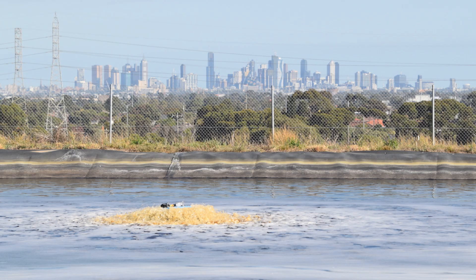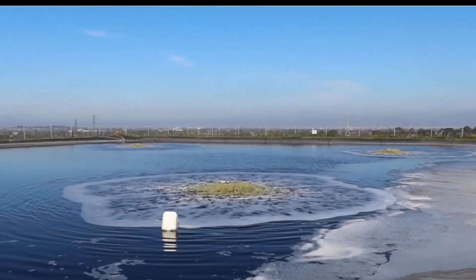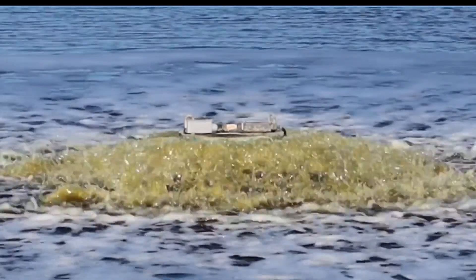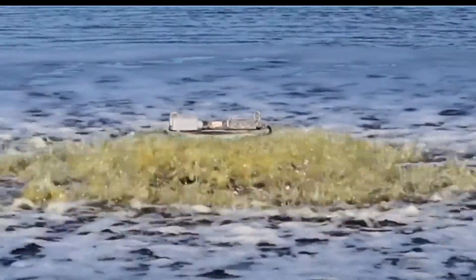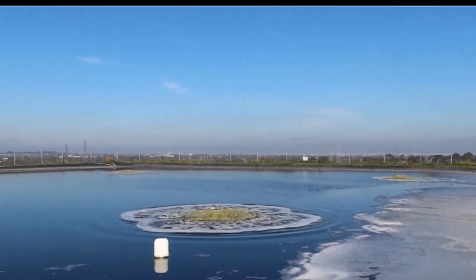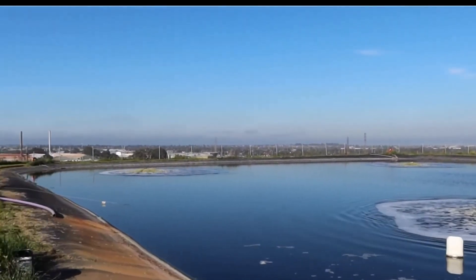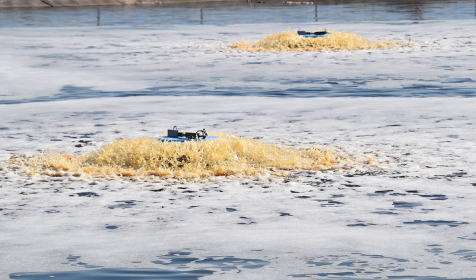They're also good in waste water. Special types of aerators should be able to mix the water as well as aerate it, because when it comes to waste water, it's very important that you not just get the oxygen in the water but distribute it throughout the pond or dam quite well, to enable all that particulate organic material in the water to be munched on by bacteria.